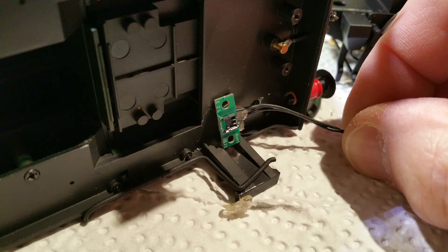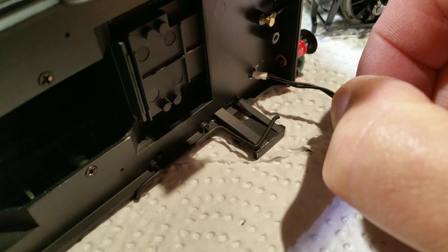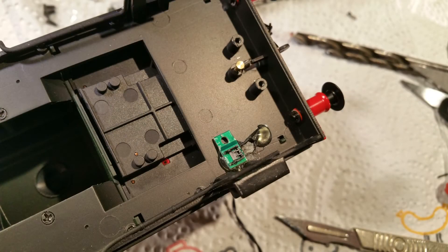This enables the lead from the motor to be unplugged from the lead to the harness. It comes with two holes for fixing to a body or chassis. In this particular case, in order to make the socket as close to the edge of the footplate as possible, we took one of the holes off, just utilising the other one to fix it in place. The lead for the LCU is soldered to the back of the 9121, and the connector fed through the hole in the footplate to attach to the LCU. The 9121 is then secured to the footplate with a blob of hot glue.